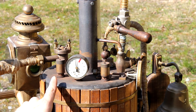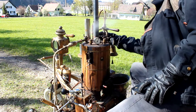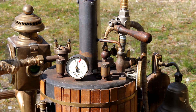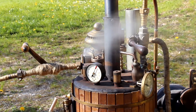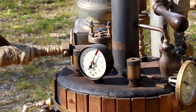Here you can see our two safety valves, which will both blow at 87 psi. This is your best life insurance and will prevent you from very bad injuries from a horrible boiler explosion. To make sure the valves are working correctly, I take a screwdriver and gently tap against the valves. If a little amount of steam blows out, everything should be okay.